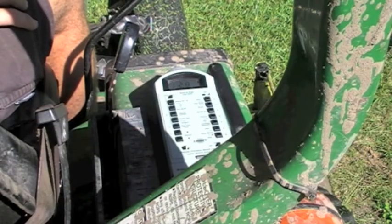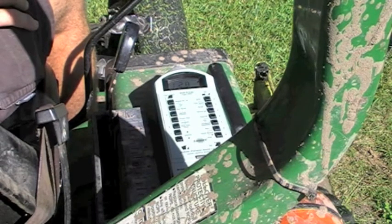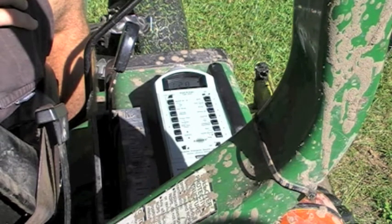The mowing has just been done for a five minute period and we've been recording the weighted acceleration across all three axes as a summed value on the vibration meter. The meter is actually recording 1.28 meters per second squared.